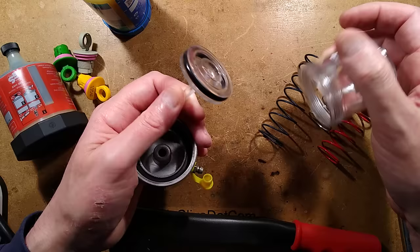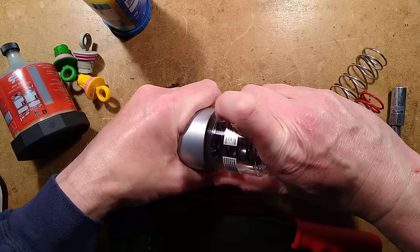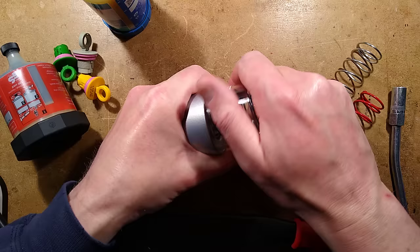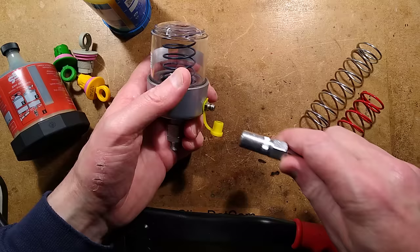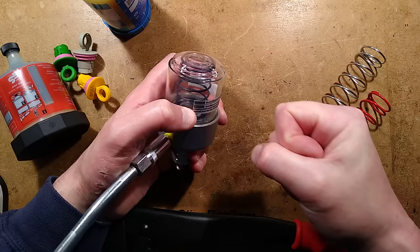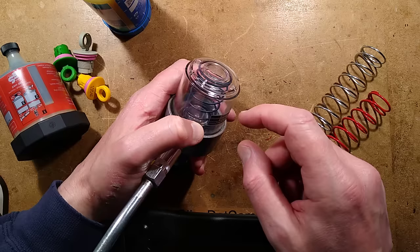The way you use these — and this thread is absolutely a nightmare to get started, especially under the power of a spring — but once you've actually set it up, that's it. The idea is you screw this permanently onto the grease nipple inlet, and you've got another grease nipple on the side. You connect your grease gun onto it and pump it up to fill that cavity with grease and push that plunger up to about this line. You don't go too far because a grease gun can put a lot of force in — there are specific warnings that if you do it too far, it'll burst the top off, and then there's a big spring to assist in that flying projectile.